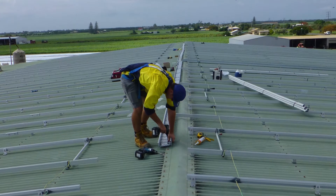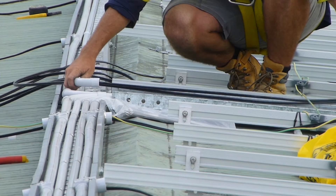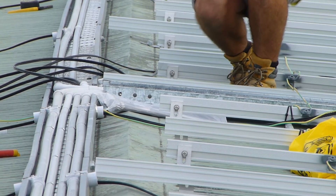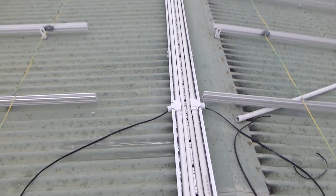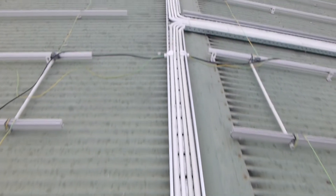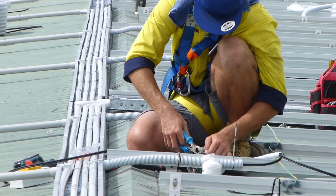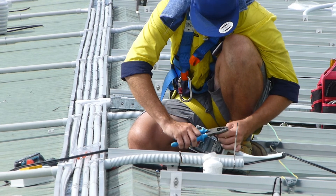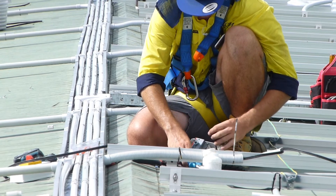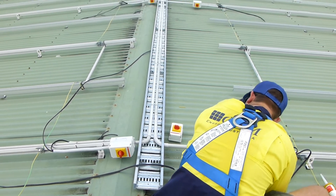In order to safely and neatly run this high voltage DC cable, we install a hot-dipped galvanised steel cable tray that is securely fastened to the roof. Any electrical cable that is exposed directly to the sun will be protected by a UV-stabilised protective conduit fastened to the cable tray. After finalising the earth and DC cable run, we move to installing the DC isolators. We start this process by preparing the internals of the isolator for the cable to be connected to. Once the isolators are prepared, they are installed onto the end of the rail system in the walkway for ease of maintenance and diagnostics.